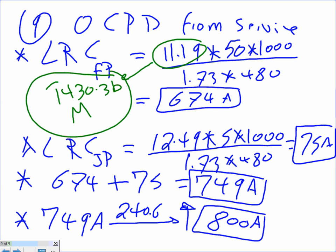This is the weird stuff. They want you to size the overcurrent protection device based on the locked rotor current. So this pump will basically run until it burns itself up in the existence of a fire. It will never trip on overload, and the circuit breaker will never trip on overload. The only time the circuit breaker will trip, guys, is if you have a high short circuit.